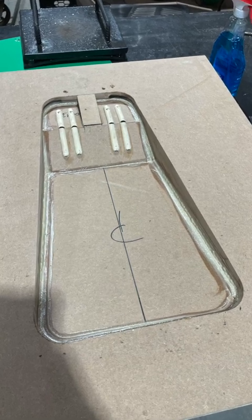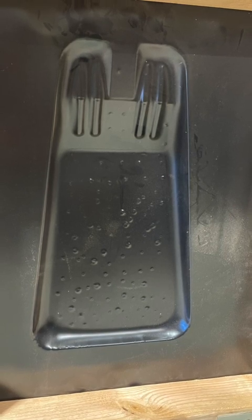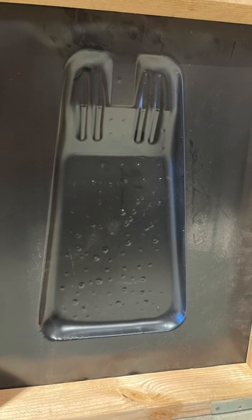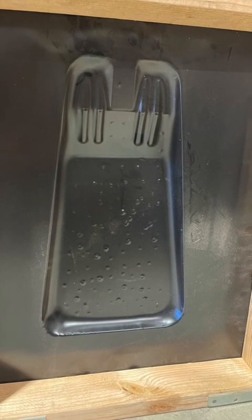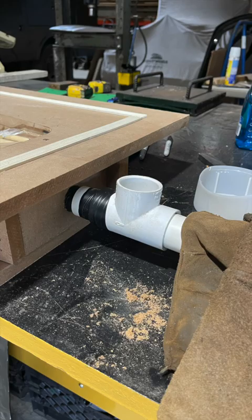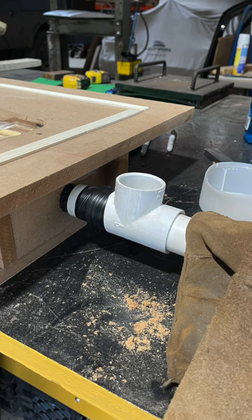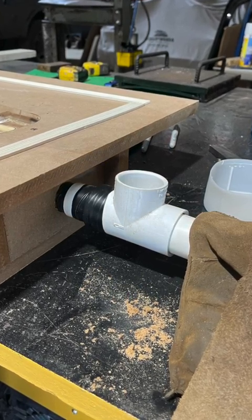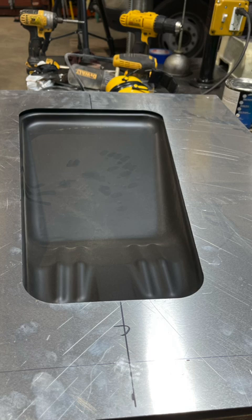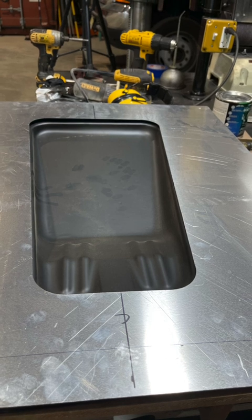This is the window shroud — this is the buck I made for it. This is the only plastic part on the whole thing. It was vacuum formed, and way back at the beginning I mentioned that plastic panel — those were vacuum formed too. I've done this before and was pretty comfortable getting back into it. That T you see on the vacuum box setup — that was so I could put my palm on top and use my hand to modulate how much vacuum I was applying, because going full force with the vacuum was capturing too much detail and all those imperfections on the form were showing up through the polystyrene.